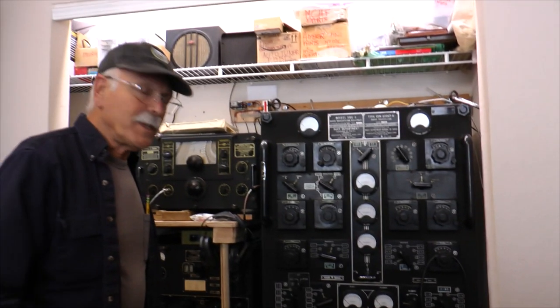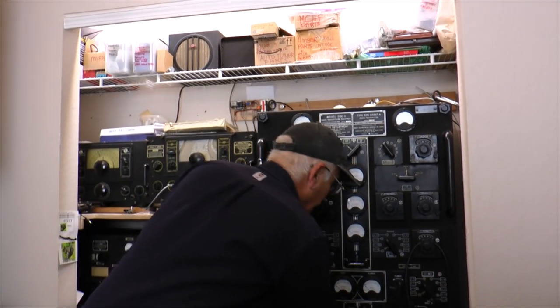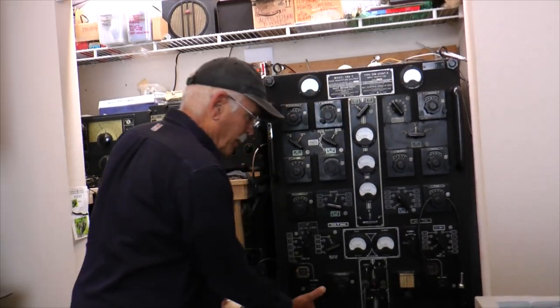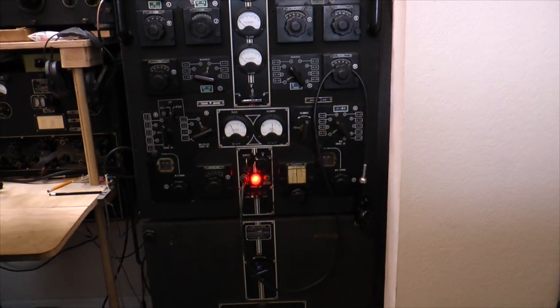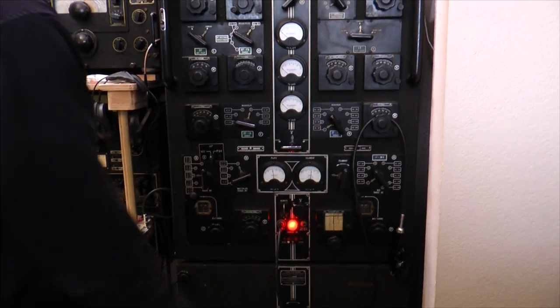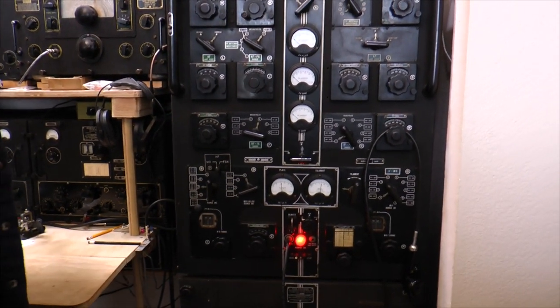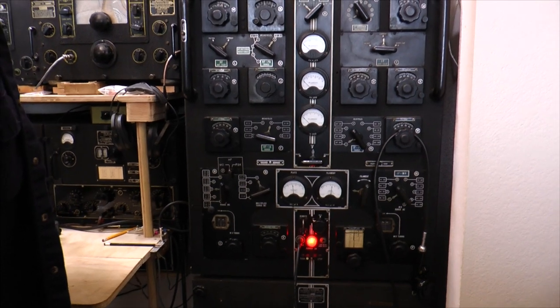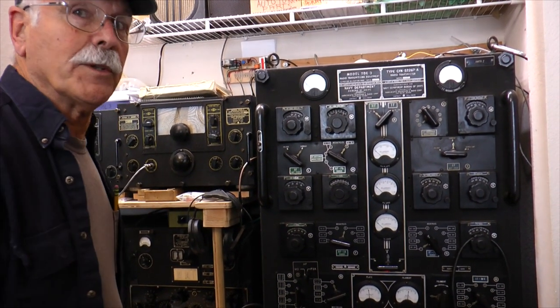It seemed like all these vintage Navy radios that had MG setups had start and stop buttons, like a regular motor starter device inside. Start it up. Your B plus comes up to 700 to 1,000 volts on residual magnetism. As soon as you key down, the voltage will kick up to the 2 kV.